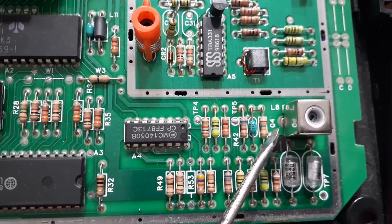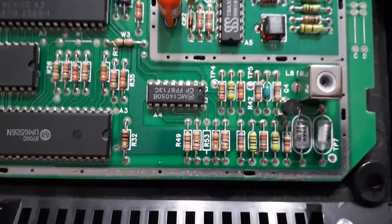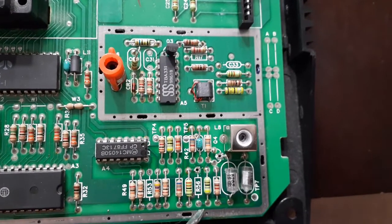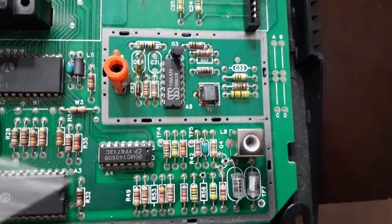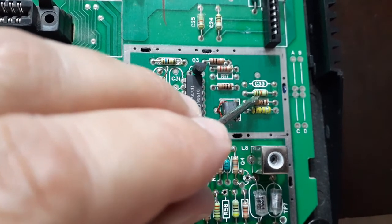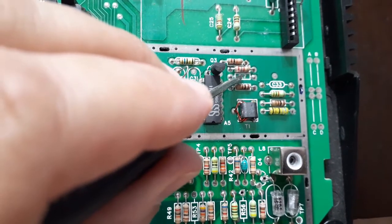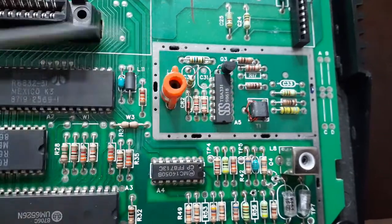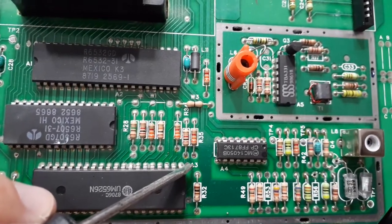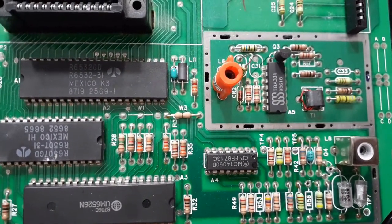Make sure you clean off these little holes and clean off this area as well - that's what the soldering iron and solder sucker are going to be for, because you're going to do some soldering here. Also note: the C-33 capacitor, which is the same color as the little green one, has to be removed, as well as the R-17 resistor. Also right over here, this little hole is going to have to be opened up. Once you've got this process in place, you can start to commence soldering your board.